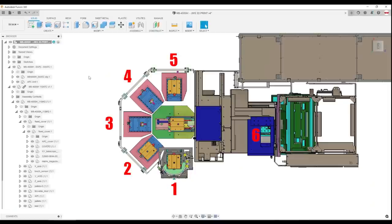With six tombstones in the machine, at any point in time, through the pallet management software we can reprioritize a pallet and immediately start running more of our Saunders pallets, reversible inserts, or top jaws. The machine is well suited with its chip management system and tool changer to complete a full run regardless of whether we're here at the shop or not. It's really a phenomenal form of automation — our first real step of detaching spindle hours from work hours. My goal is not thousands of spindle hours per year just for the sake of a metric; it's to produce what we need when we need it with minimal retooling and refixturing effort.